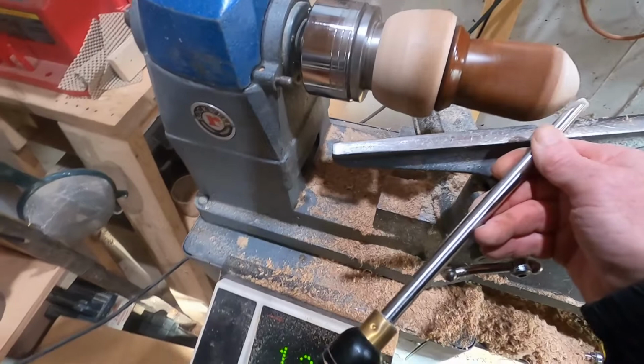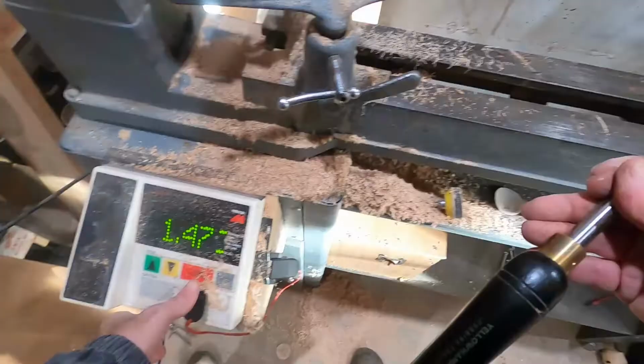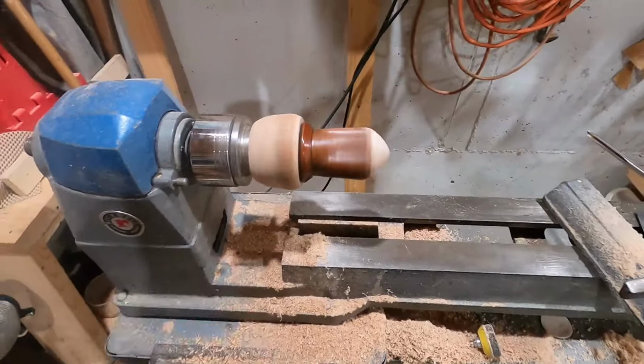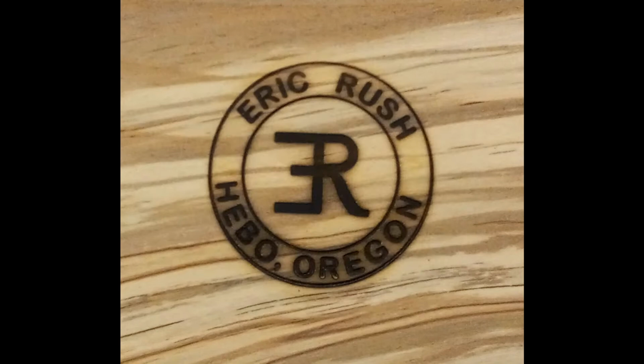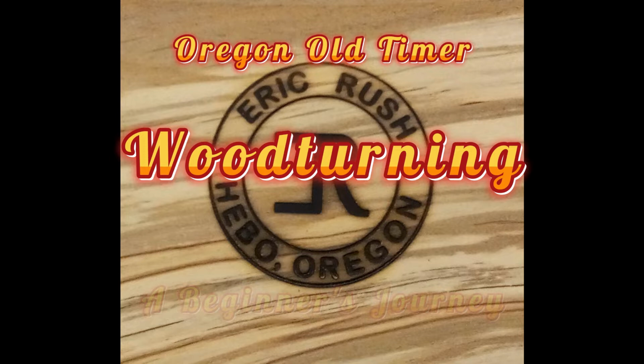My earliest project for someone other than myself was to modify a couple of very tall bedposts to short knobs. The screws in the bottoms of the 2-foot tall bedposts were the same size as the worm screw for a lathe. I cut the posts off with a saw, screwed them into a block of alder, and then turned them round and stained them, and that project was done.